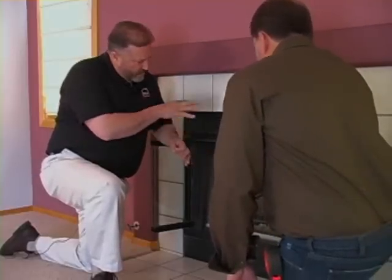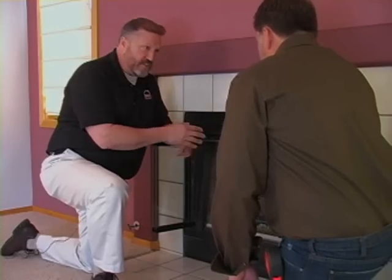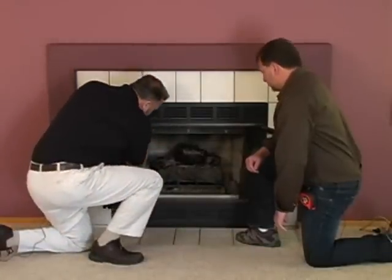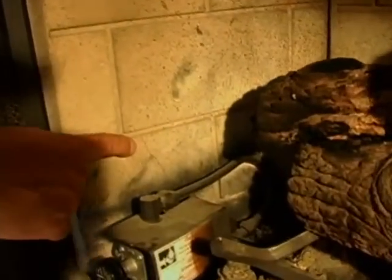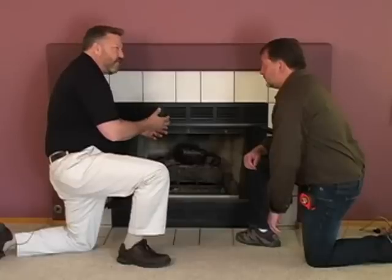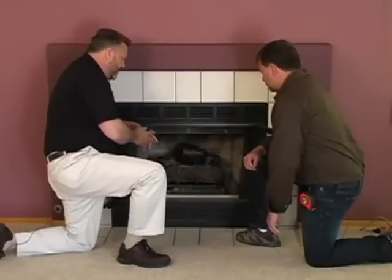Now that we've assumed this could be used as an actual wood burning system, we want to make sure that the primary heat protection — these refractory panels — are in good shape. They're essentially a clay panel. This one over here has just a very minor little crack in it; that's really nothing to be worried about. There's no material missing, and that's what we're looking for. During use, it's going to wear and you're going to have some thermal cracks. Once you start hitting it with logs, it may crack more seriously and then it will be replaced, but that's a simple procedure.